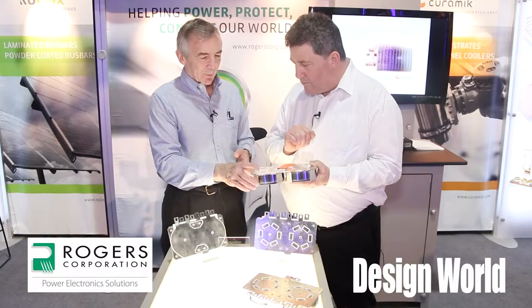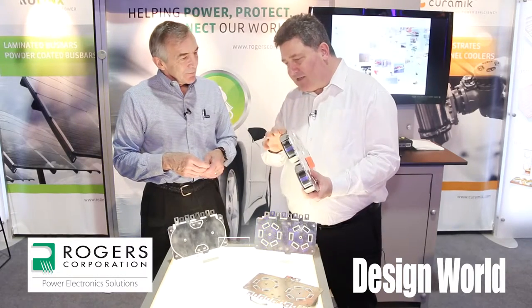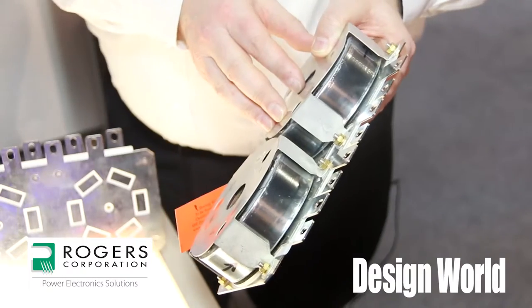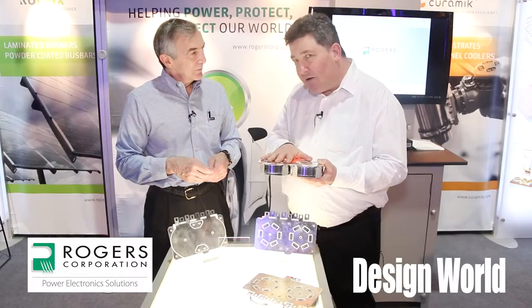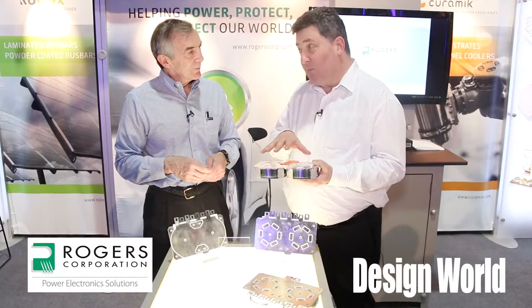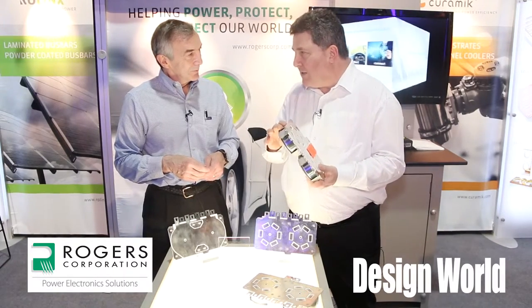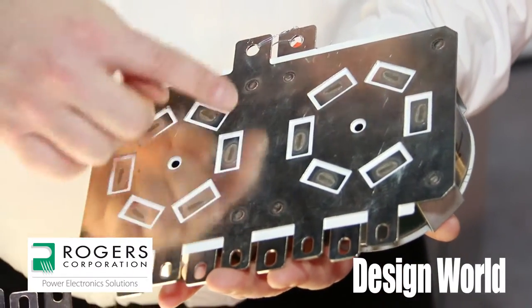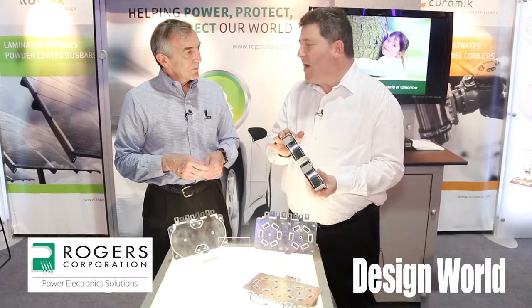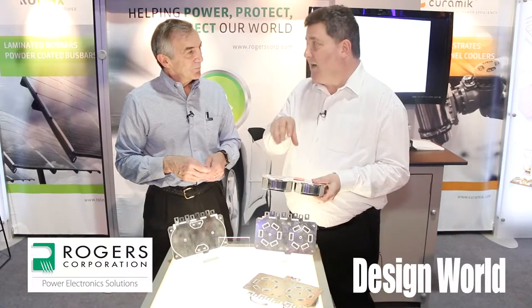How small of a capacitor will this work on? SBE has two sizes — this size of core and one which is about half the size. Everything we do is custom-made, so we can really tailor this to the application and form factor the customer wants. These capacitors come in a round puck format, a bit like an ice hockey puck. It's really the low height that creates low internal losses, giving you extremely high power density for the volume — about double what you'd get with normal can-size capacitors.